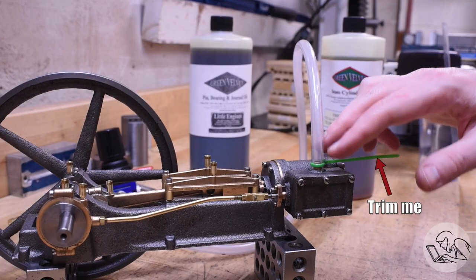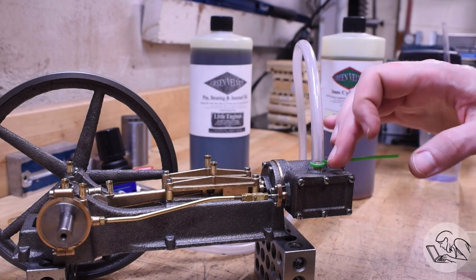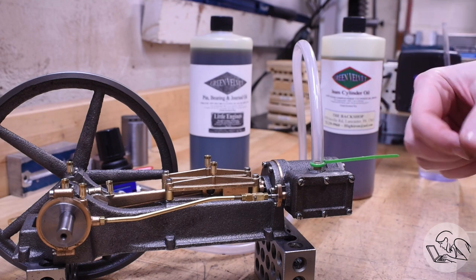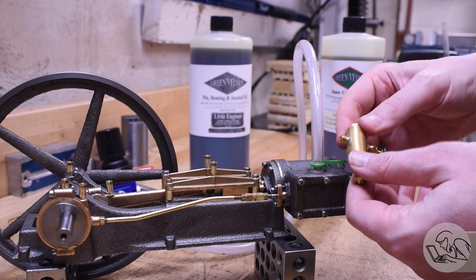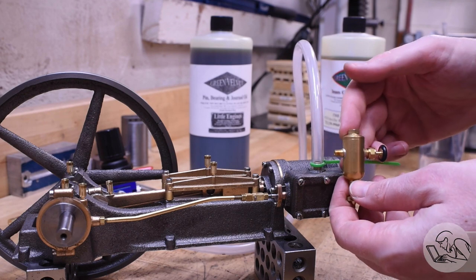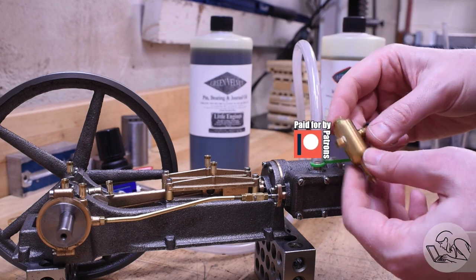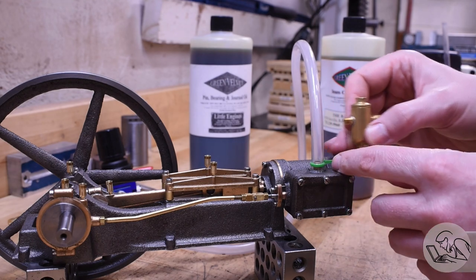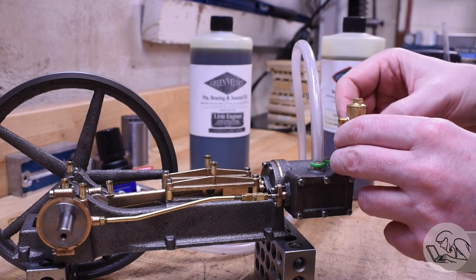I have an airline hooked up here right now, but eventually this is where the live steam will go into the steam chest. The question is how do you get the steam oil in there? You use a lubricator. There are a lot of different types, including mechanical ones you can buy or build. However, I'm going to use this guy right here — this is a displacement lubricator. These things are fiendishly clever, very simple, and very reliable. You can make these; I bought this one from PM Research — not sponsored, I did pay for it. What's cool is you just plumb them into the steam line, preferably close to the engine, and it automatically oils the engine with no moving parts.